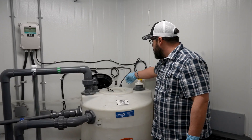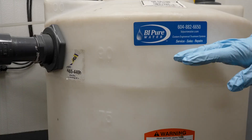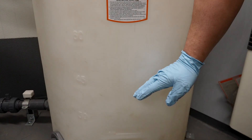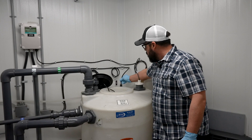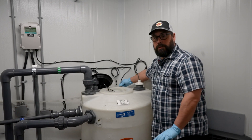If you need to adjust the heights of your floats in the tanks — whether you want to bring your shutoff up a little higher or drop your shutoff on the low end a little lower — you just unscrew the electrical wires and lift it out, then push it in to go lower into your tank.